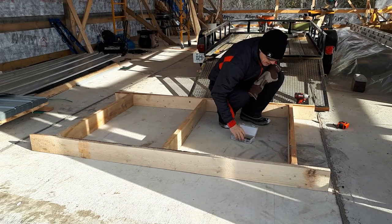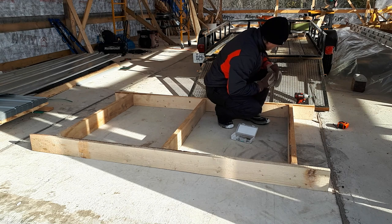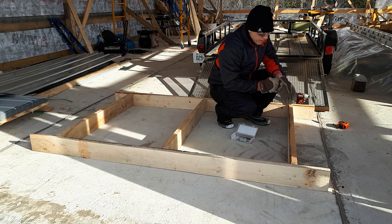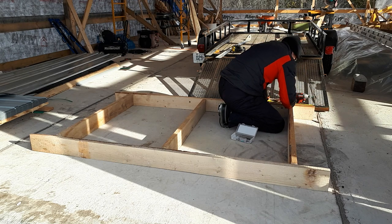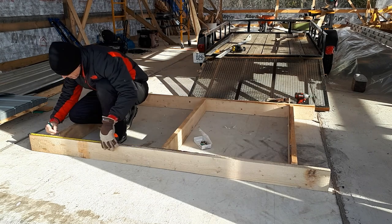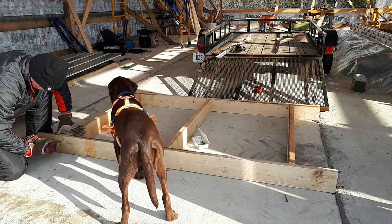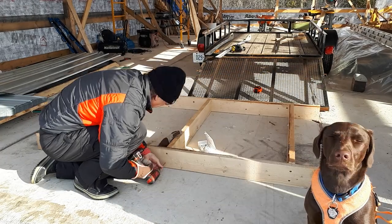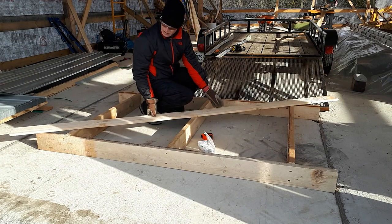A really simple approach to making this. The runners are 7 feet long and it's 4 feet 3 inches wide. I'm going to put the first board at 10 inches back, dead center, and 10 inches from the end. I secured the cross members using 3.25-inch structural screws, the same type that I used in the wall framing for the shop. And I added a diagonal board to help keep it square and give it some rigidity.